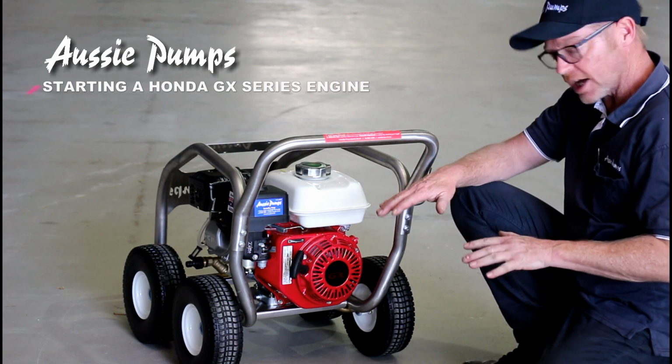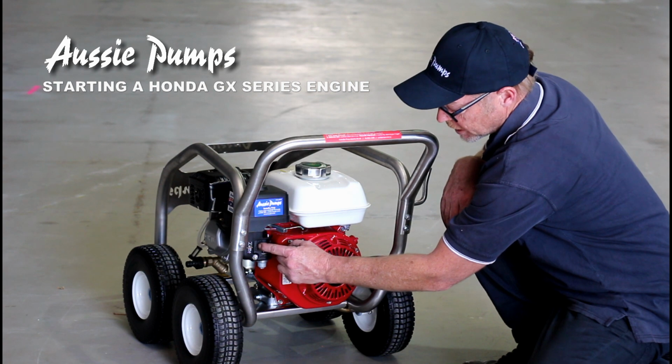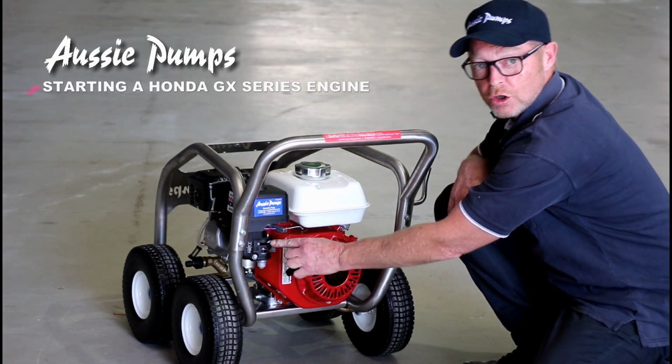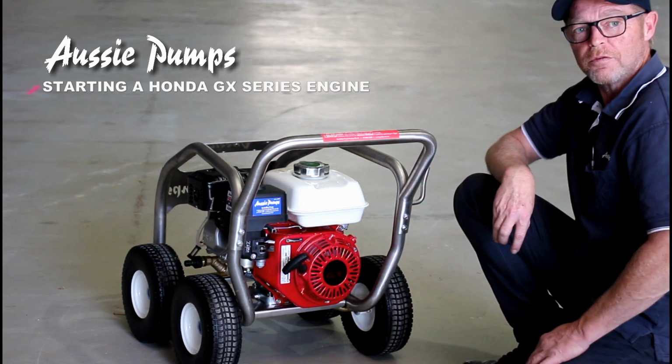Once the machine is started and it's been running for say 30 seconds or so, that's the warm-up period, you can turn your choke off. Then turn the machine up to full revs, and off you go.